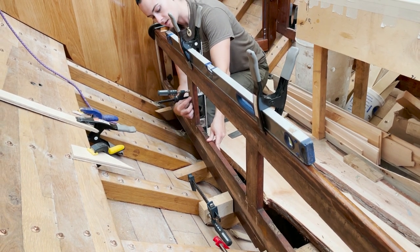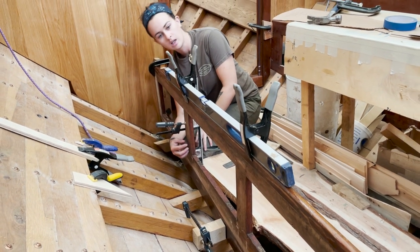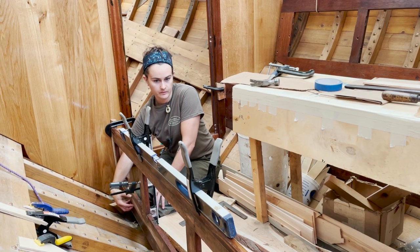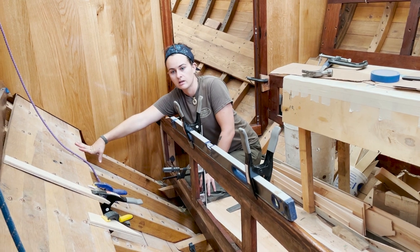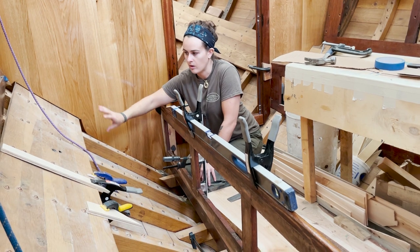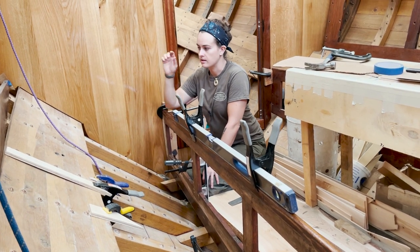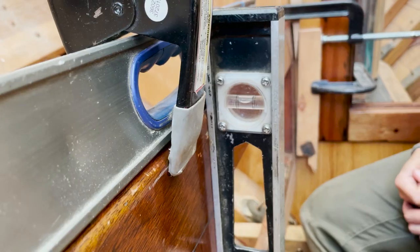And then I'm actually creating an entire oak back frame for this, and I'm doing that upstairs with just some joinery that will get clicked together and then glued in, and then the whole back frame will get screwed to this panel. And between that and a frame going across and meeting the hull, we'll have a really nice framed out oak support cage frame thing to sit a water tank in. You strap it to that, and underway, Steve will have no worries. It'll be beautiful and strong and structural.